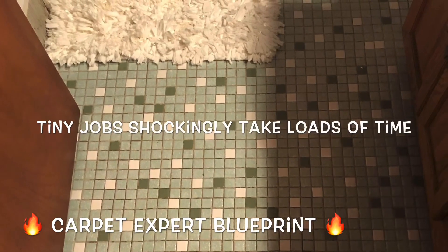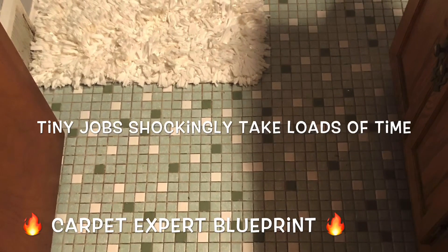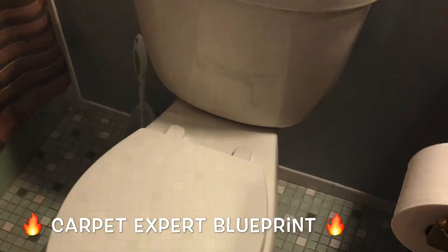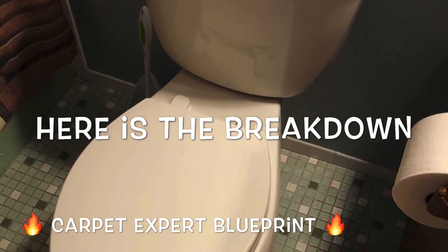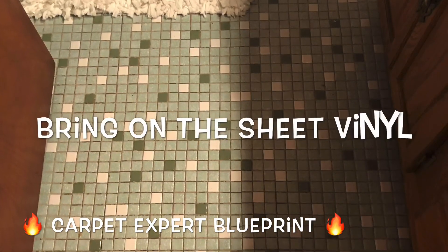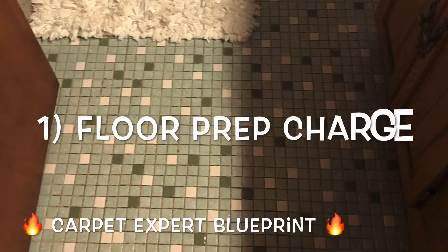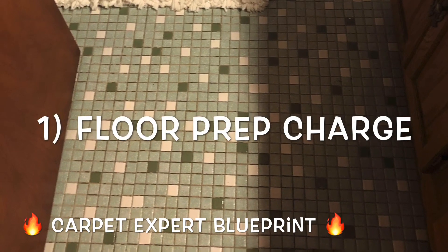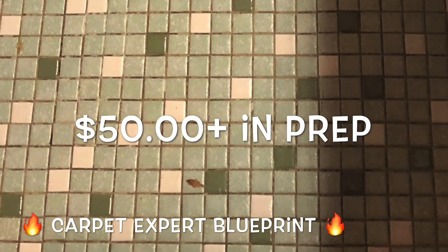For homeowners out there with a little six-by-five bathroom, you're thinking it's tiny so it can't cost that much. Installers might think it's tiny so they can get in and out. The reality is these things take time even though they're tiny. Here we have a bathroom with tiny mosaic tiles — they want to polish it up as efficiently as possible without overspending. So we're going to do a nice beefy sheet vinyl on this just to cover it up. First you've got to prep the floor — skim it to get all those grout lines filled in properly, put a fan on it, and let it dry. That's going to be $20 for a bag of prep plus about $25 to $40 for downtime.